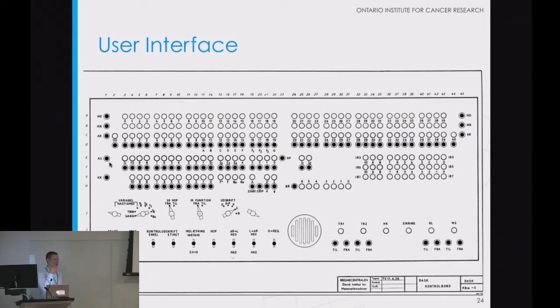And which is, I think, how they put the initial program in there, like typing it in binary, loading one instruction, typing the next instruction, and loading it in. The next one down is the address register and the operator register, the control register, and the binary counter over here. And then you have the index registers, which you can't zero, but they're just displayed.